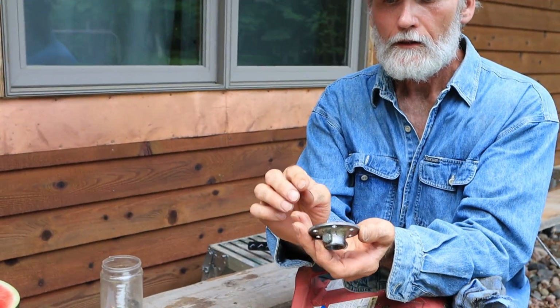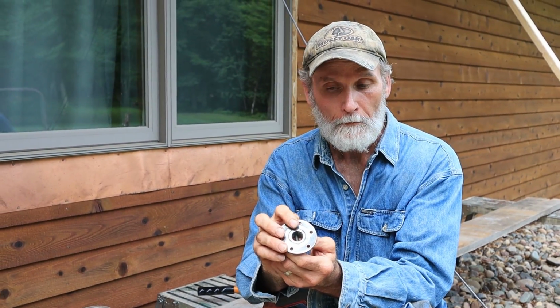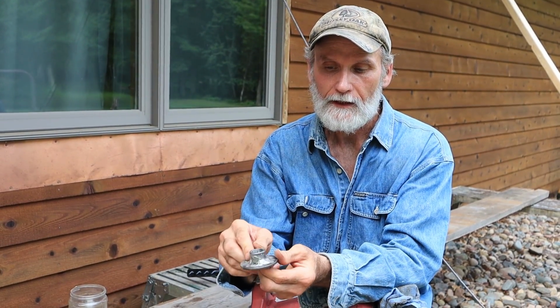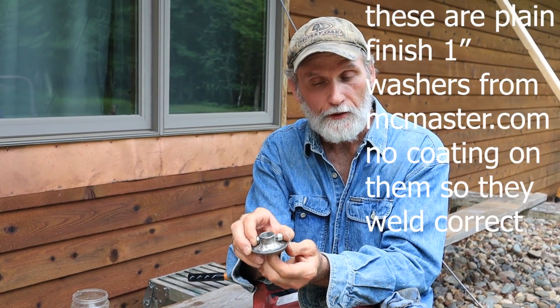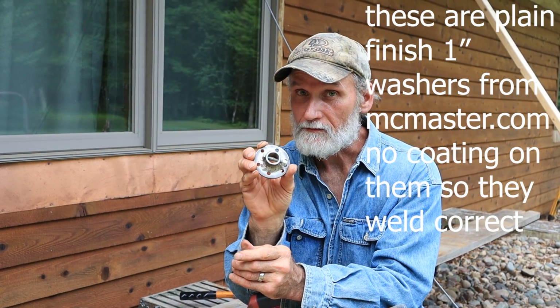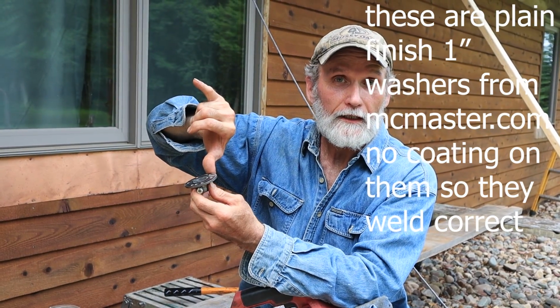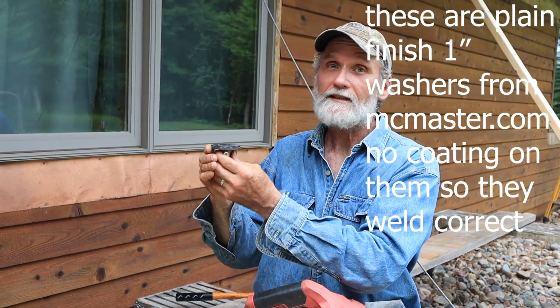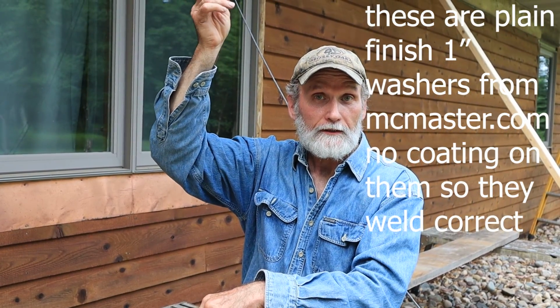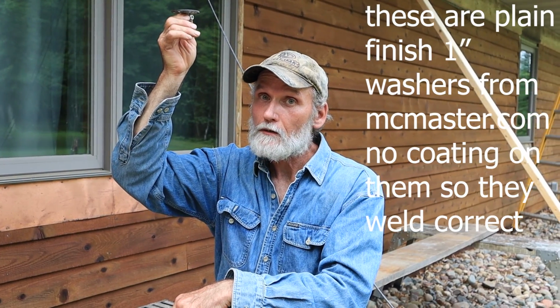Now this is, we get these parts, well, the washer, this is actually just a washer with a piece of 1/2 inch Schedule 80 pipe that's inside of it, and a 1/4 inch bolt that's drilled through it, and it's welded into one solid unit. This is very nice, but you can fasten this, and we'll use the 6 3/8 inch long GRK screws, and we'll put 6 of them and fasten them up to a ridge beam or something where there's substance up there, someplace that can hold the load that you're putting on.